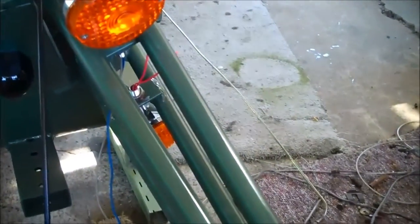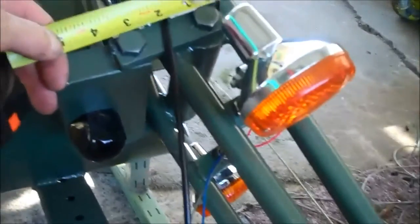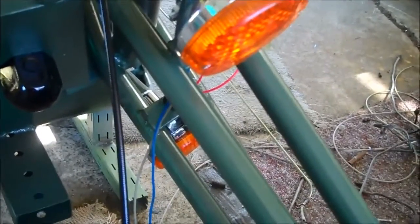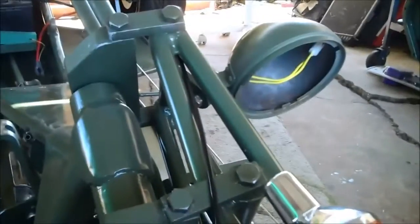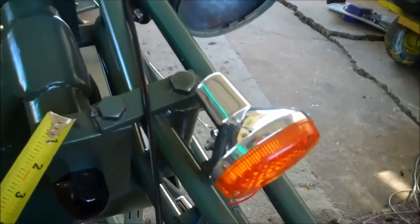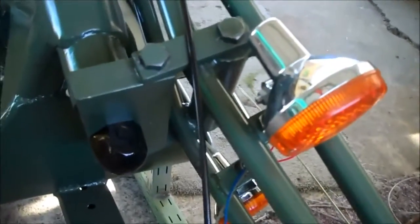For the front end itself, you need a twenty-foot stick of three-quarter inch solid cold rolled steel. The upper straps — I generally buy sixteen inches and then they're all cut down to whatever they need to be. When you build a scooter, these are cut to whatever they're supposed to be, because each scooter might be a little different.